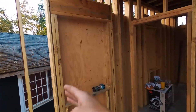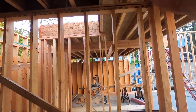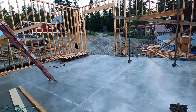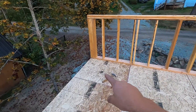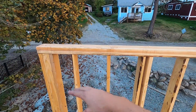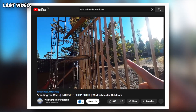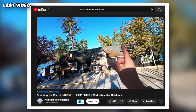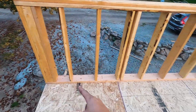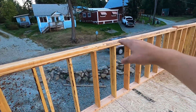Sheeting is on to the 16-foot mark. We're nailing up some final stuff upstairs — all the way through underneath the mezzanine that sheeting is on, and it is much more stable upstairs. Up here we've got that wall that we had to cut off — if you go back a couple videos ago you'll see that we made a mistake here; we cut the wall off. We're going to fix that, and I'm glad we caught it early because that means this back wall, the other sidewall, and the front will all be fixed. We now have it reattached where it should be and it finishes off up to that 14-foot height so the trusses can sit on top.